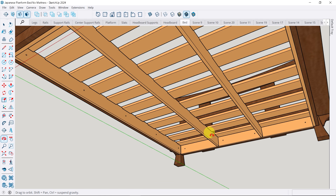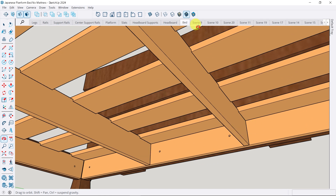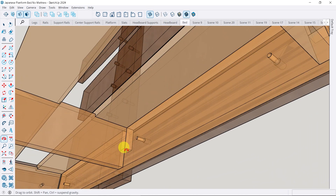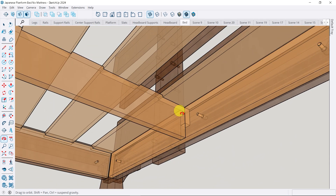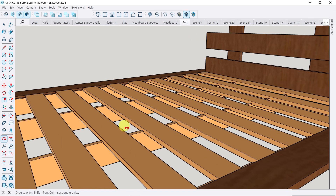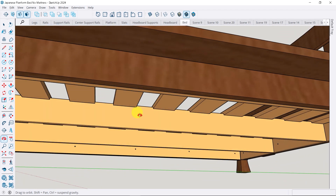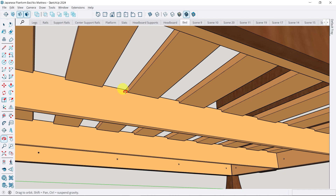The long rails that go along the center are going to interconnect with the other plywood face. You can see there's an overlap joint happening right there, and those will just be floating in place. We also implemented spacer notches into the design for all the supports that go across the width, so those will simply key into the right positions, controlling the spacing automatically.